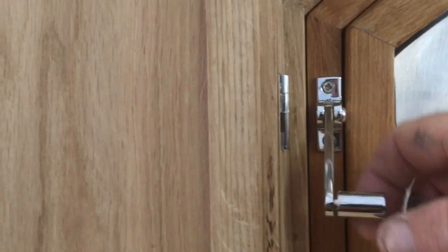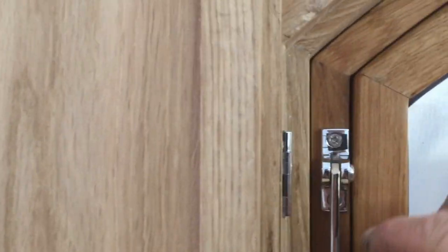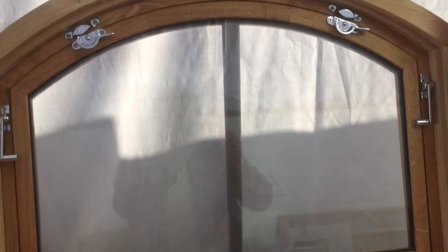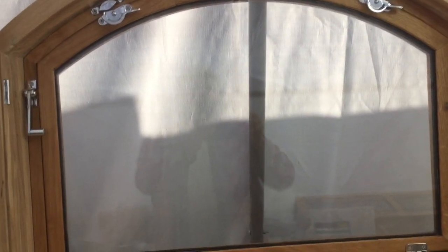I've got all the catches on the windows. That opens up and I've got the roller stays on the sides — I had to buy them in and they came longer than needed, so I took them apart, took the pins out, cut the arm back and redrilled it. There's a little bit of chrome missing there but you don't really notice it and it's done the job. Three hinges along the bottom. I'm really pleased with the archtop windows. I'm going to crack on because I've still got quite a few bits to prepare ready for the trip up to the boat on Tuesday.